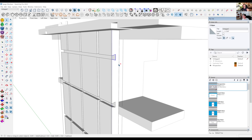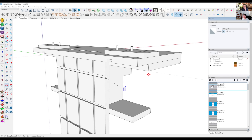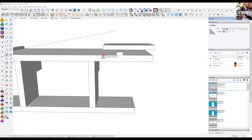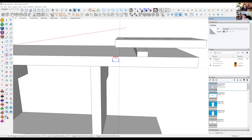Take that dovetail piece and put it in the sub-base. If there were a slot there, that would allow sliding front to back. So you're thinking just a slot somewhere in there — two of them, to keep that top piece maintaining parallelism as much as possible. Just like his little add-on hardwood runner, you'd have a slot on each side.